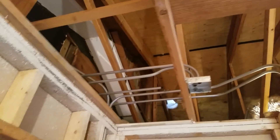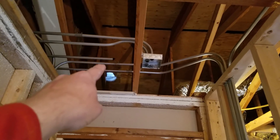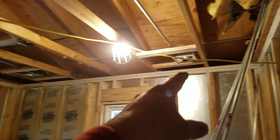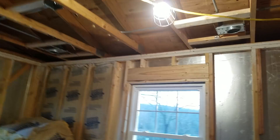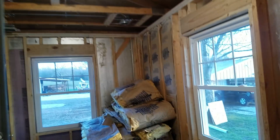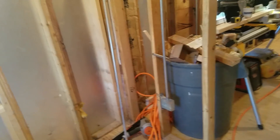This is all piped in — smoke alarm. I wish I could have gotten my can centered but I'm not going to reframe the ceiling. That feed right there is for the bathroom which I'm working on now. This room is going to have four cans and a ceiling fan. In here I've got an outlet behind the wall because the bed is going to go there, so outlet, outlet, another outlet under my switch, and an outlet in this corner.